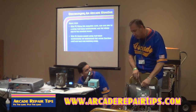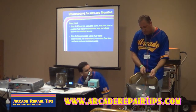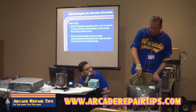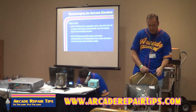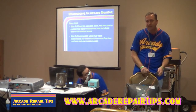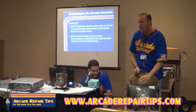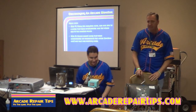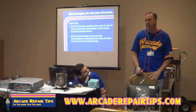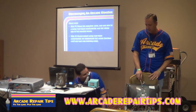And so I'm actually going to use the screwdriver as a tool to get that out of there. Where the pop usually comes from is this hole, and that's a mistake a lot of people make. They're popping over here and not seeing anything. Then they go with their wedding ring or something, come back over this way and pow. Good idea to take off all wedding rings. Tell your wife you're sorry, you'll put it right back on, but for the time being, you want to do that.